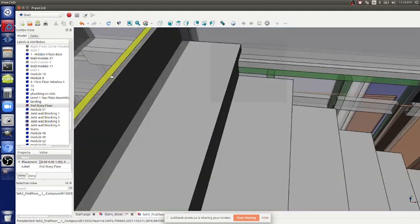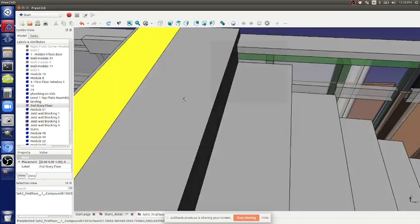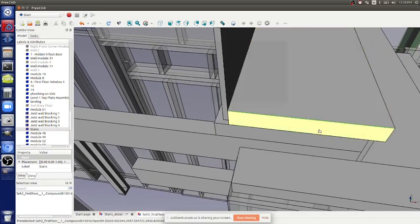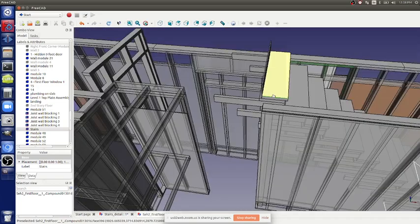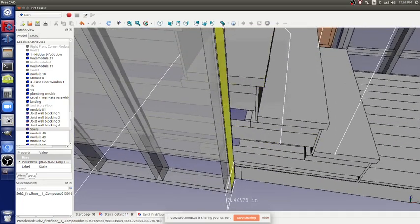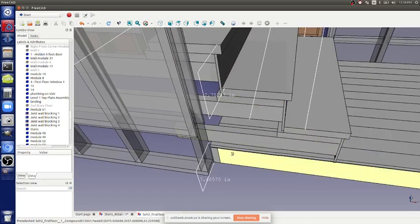So what does that detail look like there? Well, anyway, we know that this thing has to rise. The top surface here has to be 7.5 below the top step. So are we 7.5 for real everywhere, for every rise? Let's measure this one here from this surface to that. What's going on? 7.75?